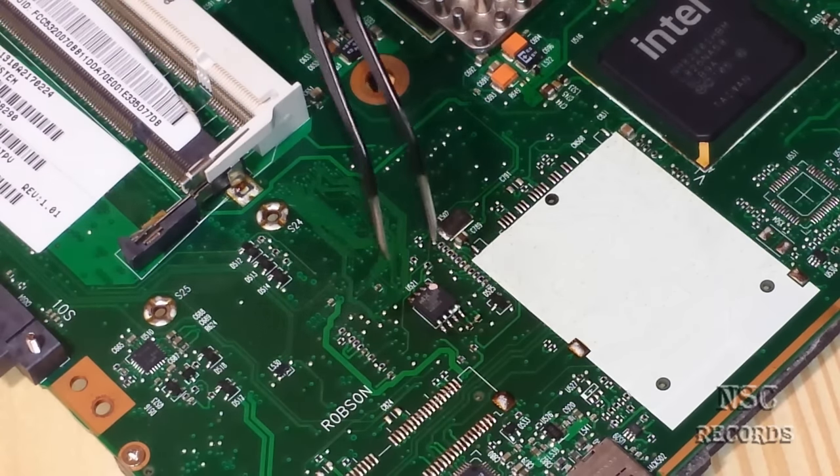You now need to be fast - go here with your soldering iron and solder on the left side, then the right side, then the left side again, doing that really fast so you can move the chip slowly away. Like I also prefer to do that with a heat gun, but as you can see we now have our chip out. Now we just need to clean it.